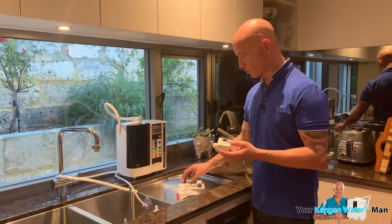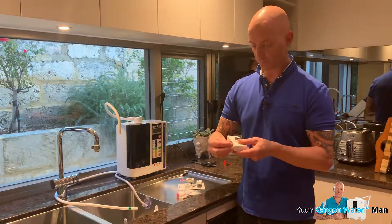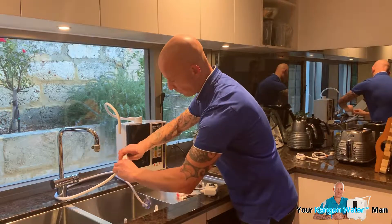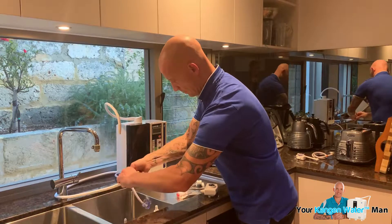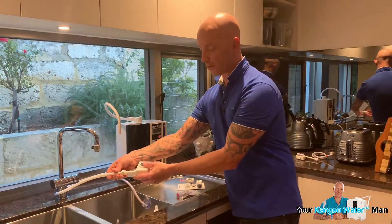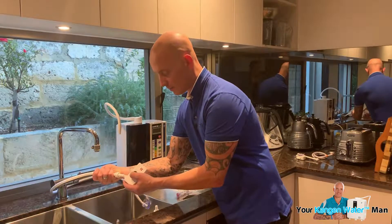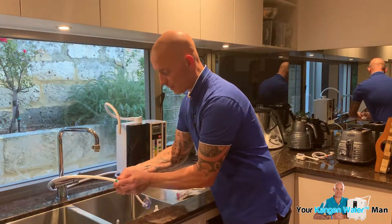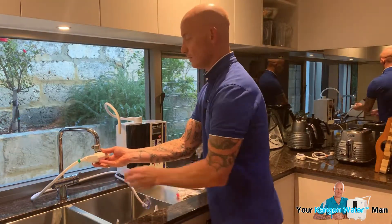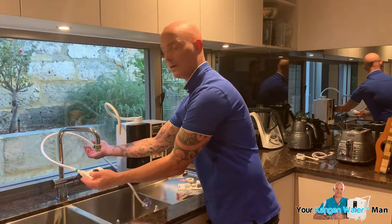You can certainly use it should you choose to, and you can cut it shorter if you wish. What you do is unscrew this white piece at the back and put it over the pipe. Now, one important thing I always do: if you put that on straight away and straight, when you tighten it up it will start to twist. So I always turn it the other way and put it on, and then when I bring it forward and tighten it, it actually fits in nicely. I've kept it so it's pushing down to keep it neat - so it's not up here looking like a mess.